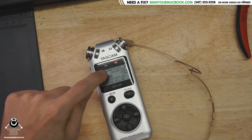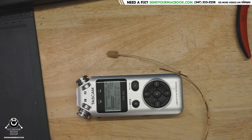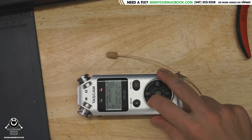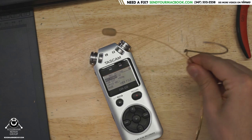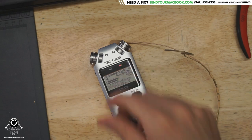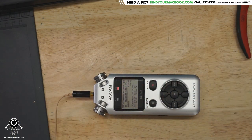So as you can see here, it's in record standby mode and you can see that both of the mics are working. You can see the bars are moving on the left and the right. If I tap the left, you can see the left move more. And if I tap the right, you can see the right move more. Now it has something called plug power, which is kind of like this lower version of phantom power that a lot of these DPA and Countryman mics will use. Mic power is set to on. The DPA has now been plugged in and I have it right to my mouth and you can see the level meter is moving.